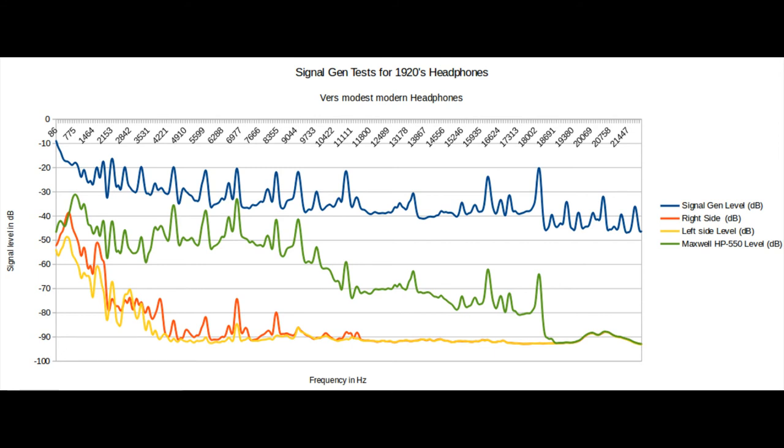And for really early recordings, back in the day when these headsets were used, people might have been transmitting music via gramophone records or maybe live performances with really early equipment. The losses for these headsets probably didn't matter a whole lot because the whole signal getting to the listener up to that point was already pretty challenged. But considering how low a load these headsets present to really early circuitry, that they're able to produce what they're able to produce, I think is pretty cool.